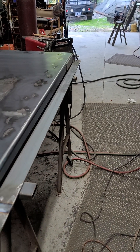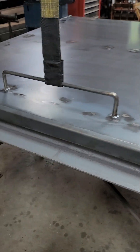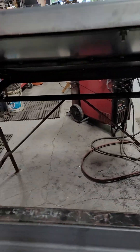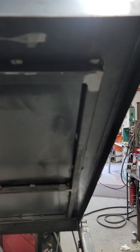I thought I'd take a minute to show what's going on in the shop right now. I'm working on a hatch cover for a house — it's replacing an old house in downtown Murfreesboro where they used to have two double doors that came up. Instead of those two wooden double doors, which are all rotted out, I created a new frame out of 16 gauge metal with a little substrate underneath and another frame of 14 gauge.